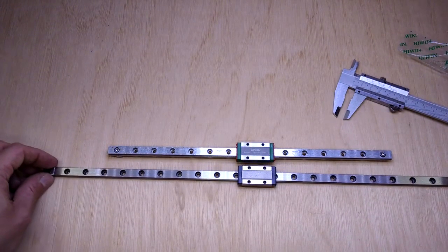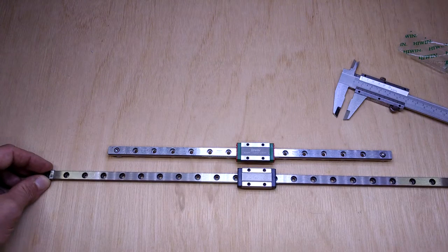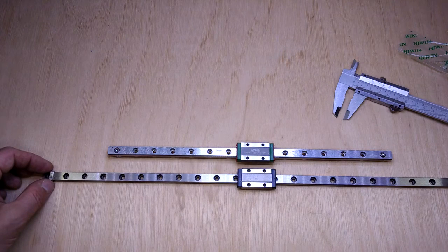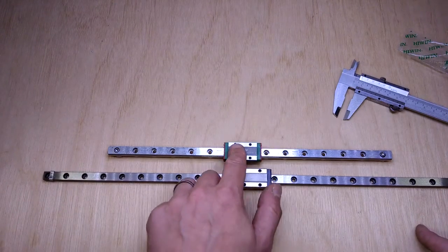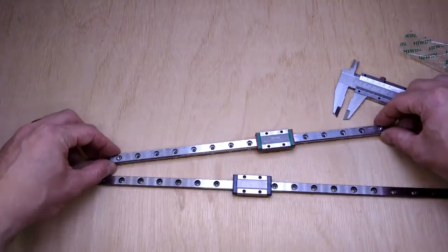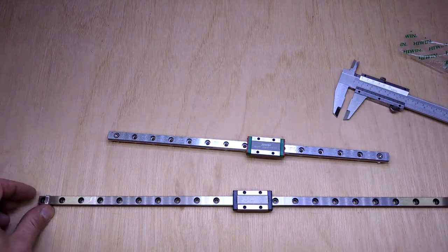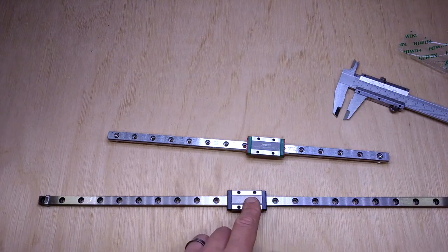So I'm going to leave it there for now. I'm going to try and do some tests to work out what kind of deflections we'll get under loads, using some static experiments rather than dynamic ones to start with before attaching it to the printer — just to see whether there's anything noticeable. And I might also see if we can check out whether the friction is noticeably different, and whether torquing in that direction ends up with significant deflections which might mess up the finish on a 3D print.